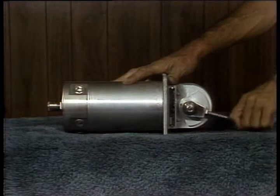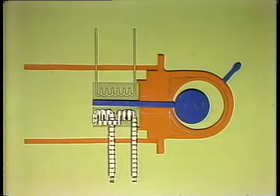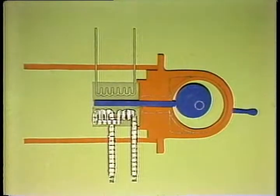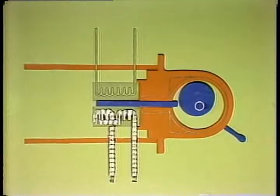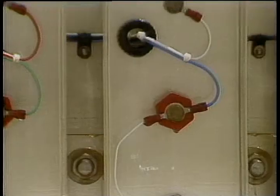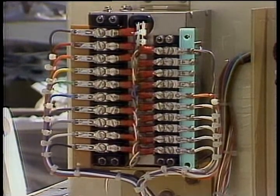The driller's control is actually a cam-operated differential transformer. The control handle rotates the cam against a movable core in the transformer. Depending on the position of the handle and core, a secondary output of about 3 to 12 volts AC is obtained. The unloaded output would be 3 to 18 volts. This throttle signal goes back to the control box to the firing module. Here, it develops a DC control voltage for the firing circuit, which produces the pulses that gate the SCRs.